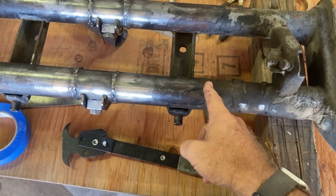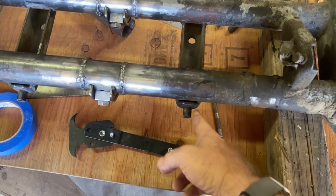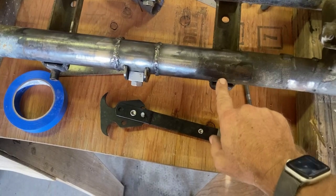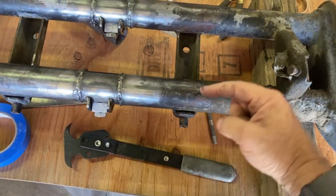I'm also planning on having my cut as close as I can to this bracket so that the sleeve will sit in this section. I'm going to drill a few holes to spot weld through and then weld around.